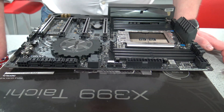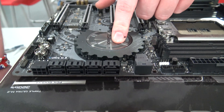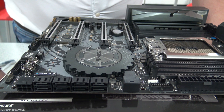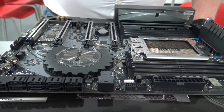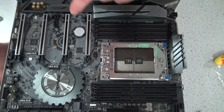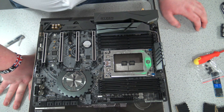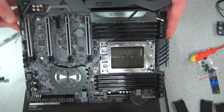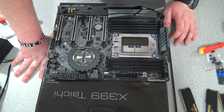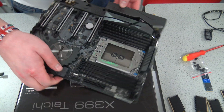On this board you've got eight SATA ports, which is a lot more rare on standard Ryzen boards due to bandwidth issues. You've also got a U.2 connector for really high-speed NVMe storage — another workstation requirement. There's an incredible number of fan headers as well — at least five or six system headers. It's a decent board, and this is one reason I went with it; we had an Asus one before but kept having issues so we sent it back and went with the ASRock.